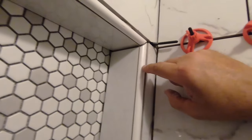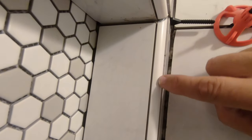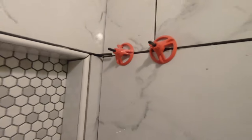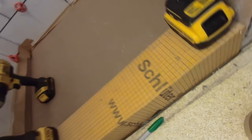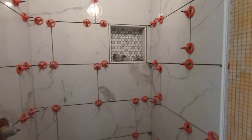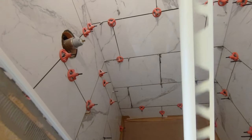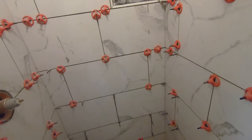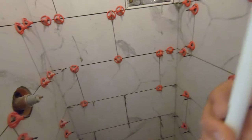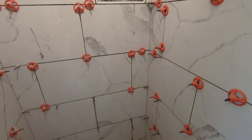You can see there is a grout gap between the edge and the tile. These edges come in all kinds of different colors and textures. Ours are done by Schluter — Schluter makes all kinds of different edges. This one is plastic, but they come in metal as well, and again in all kinds of different colors. What this does is provide that round beveled surface to dress up the tile so you don't have an exposed outside edge.